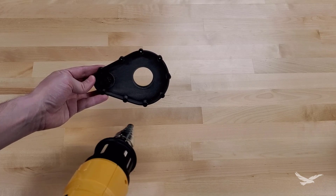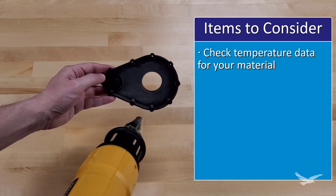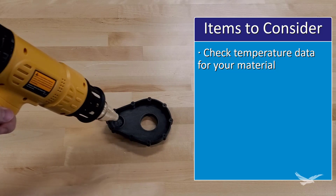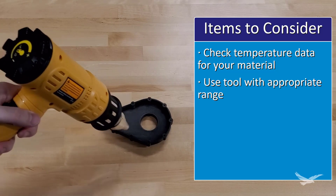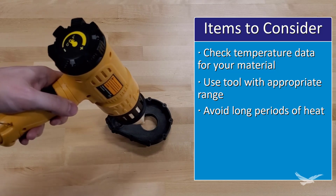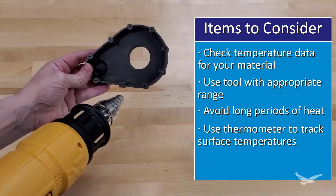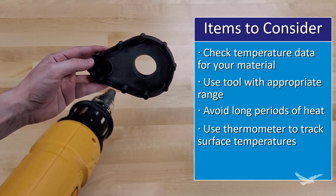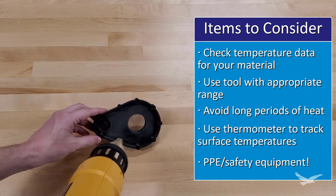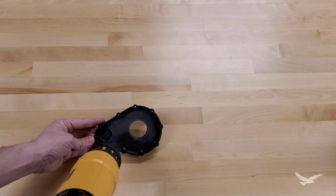This one can be a little tricky, and there are quite a few things to consider. First, every material has its upper temperature limits, so you couldn't use the same heat settings on Markforged PLA as you would with Onyx. You would need to find a heat gun with lower limits that fit your material properties. It can also be easy to melt certain sections of your part if you concentrate the heat for too long, which is why the tool is being fanned around. A laser thermometer would make this process far more accurate. For this specific material, the geometry is getting between 150 and 200 Celsius, which means gloves should probably be used. But if you can get the hang of this, you can turn around a part in only a few minutes and get that dulled surface back to its original color.